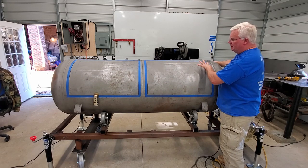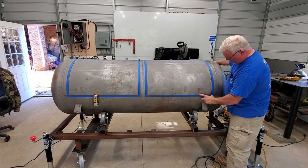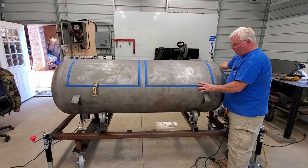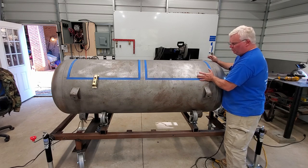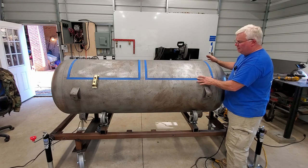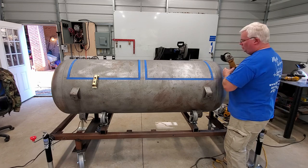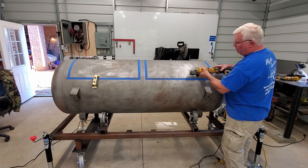I think it's a lot easier on the saw. I've run about six inches to make the plunge a whole lot gentler on the saw, and it's a lot safer if you go ahead and do that. Obviously the plunge into the metal — or wood or whatever you happen to be cutting — is hardest on the saw and the blade, and it can be dangerous. So if you're not used to doing plunge cuts, I would recommend just using the angle grinder with the 1.2 millimeter or 1/16th inch blade and work all the way around.